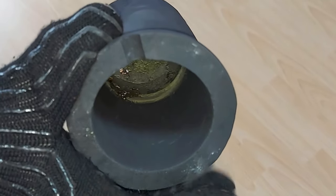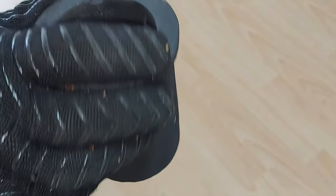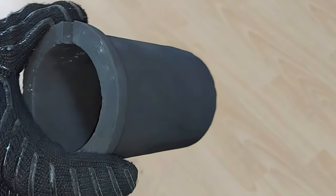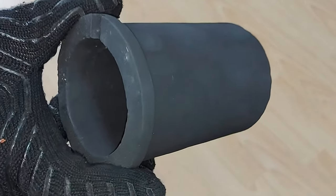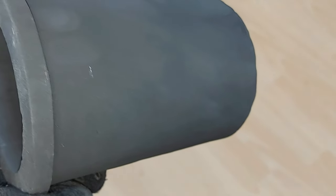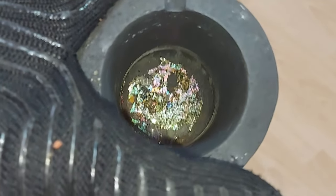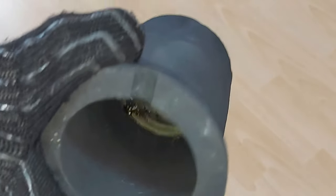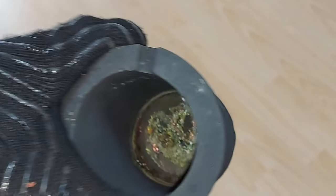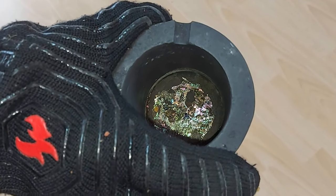The last item you probably need to buy on this list would be a proper crucible. I suggest a steel one, because special crucibles like the graphite one I am going to use deliberately will be destroyed by this method. Graphite crucibles are designed for special electric stoves or ovens, but in this case the graphite will react with the charcoal and the result will be an oxidized crucible. How this looks will be visible in the third and fourth parts.